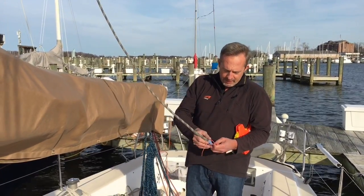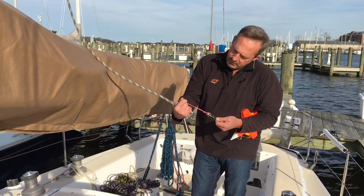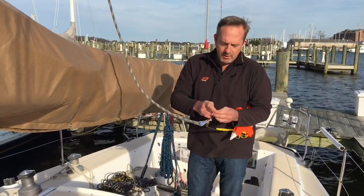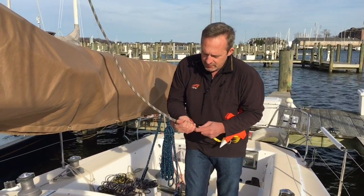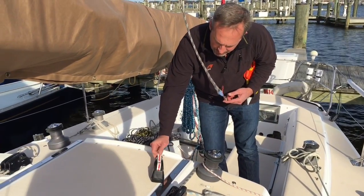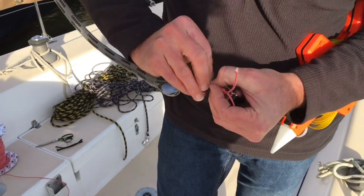I'm going to measure this main halyard, and I'll talk through the differences between doing the main, a jib, or a spinnaker as we go through this. On my tape measure I have a piece of halyard leader tied on very securely. I'm making sure the shackle is closed tightly, and I'm going to tie the end on here with at least three overhand knots. If this were to come apart, somebody's going up in a harness or a bosun's chair to retrieve it. So an ounce of prevention — tape your knots when you're doing these kinds of things so they can't come undone.